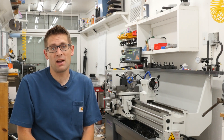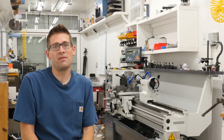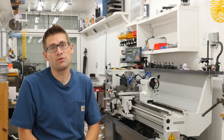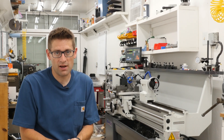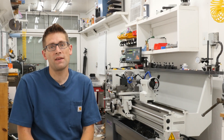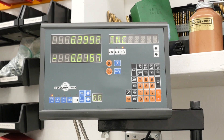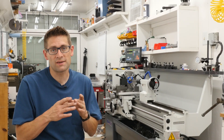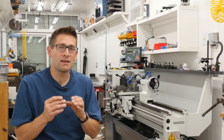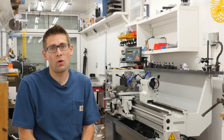With the lathe in place I was hugely relieved. It was practically time to crack a cold one, but we had more work to do. I wired up the single phase 240-volt power and got that in place. I did a rough leveling job just to make sure we were in the right vicinity and fired the machine up — everything was good. Then came installing the DRO display. I ordered this with the Precision Matthews 2-axis DRO. It's got a high-resolution cross slide DRO scale with tenth-of-a-thousandth resolution, so on a diameter you get two-tenths of a thousandth resolution. Amazing. I haven't had a DRO on a lathe before — I'd just rigged up temporary solutions with digital calipers to get some measurements.